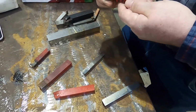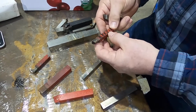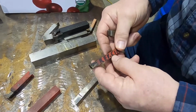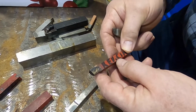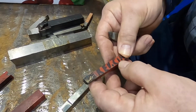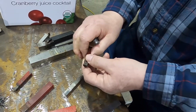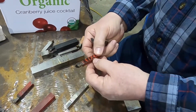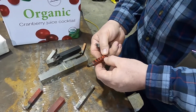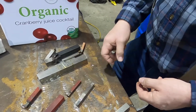And this one is a Yugoslavia. This was probably, again, a C6, C5, and since I know that that's not 5/16, it must be a C6 for the size and C5 for the grade. It could be the other way around if it was 5/16, because C6 is also a grade. But as it is, the C5 must be the grade and the C6 is the size, because that's the 3/8.